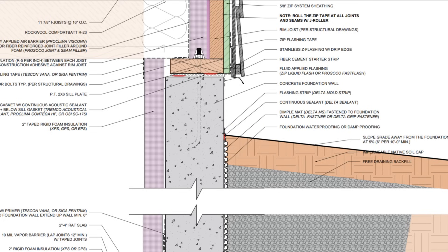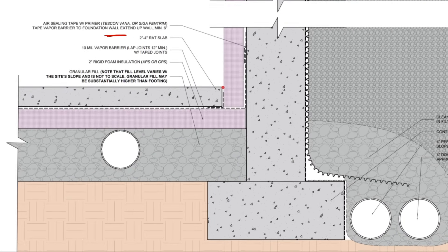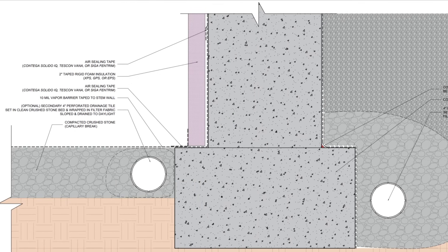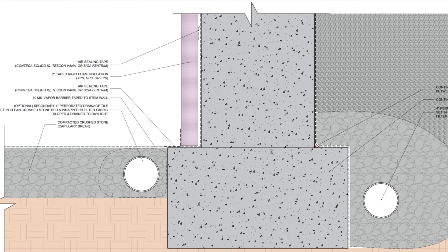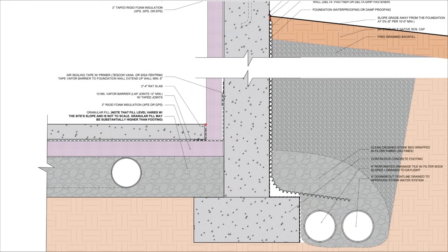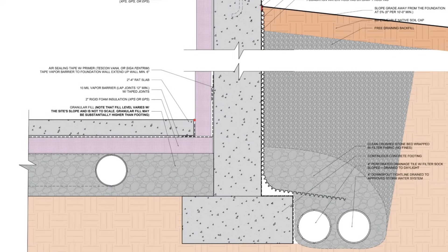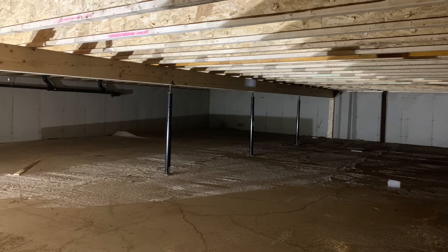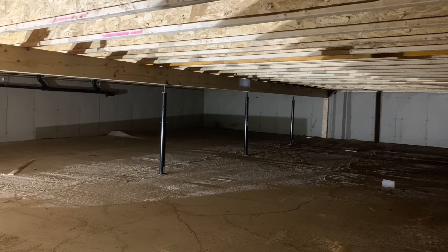Then on the interior side is where things get a lot more interesting. We put down that same polyethylene vapor barrier over the ground and tape it to the stem walls. However, we're insulating below it with some rigid insulation to reduce temperature differentials between the crawlspace and the rest of the home. In some warmer climates, you can omit this rigid insulation layer, especially if you want to take advantage of the cooling benefits. Then we don't just stop with the vapor barrier — we pour a thin 2-inch concrete slab over the vapor barrier, called a rat slab, and this is providing several key benefits to this assembly.